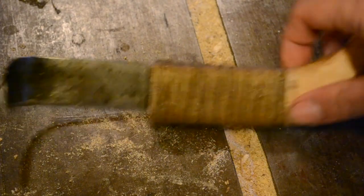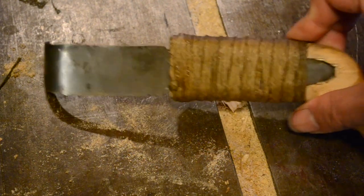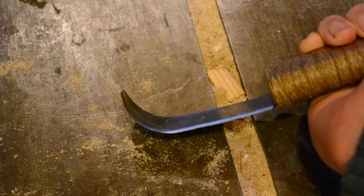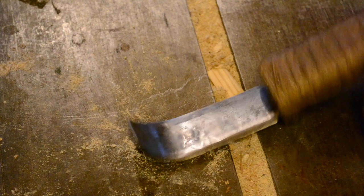These examples, like many historical examples, were made out of a recycled saw blade with only cold forging techniques. Saw blades are well suited to recycling in this way. Saws are very well tempered, so provided you don't overheat the blade during grinding, you don't have to do any heat treatment.